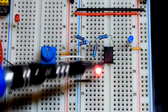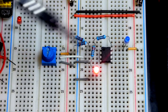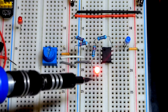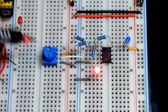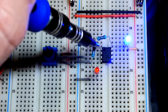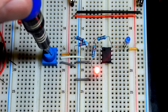And finally, flashing LEDs are nice. So if you've seen my other videos, I got it wired so the blue LED lights up when the output's low. You can see the long lead, the anode, to the positive supply there. The red LED I have to light when the output is high. You can see the short lead, the cathode, to ground right there. And so the other side of the power supply has to be coming out of the output, as close as it can get. It's going to fall short both directions here.